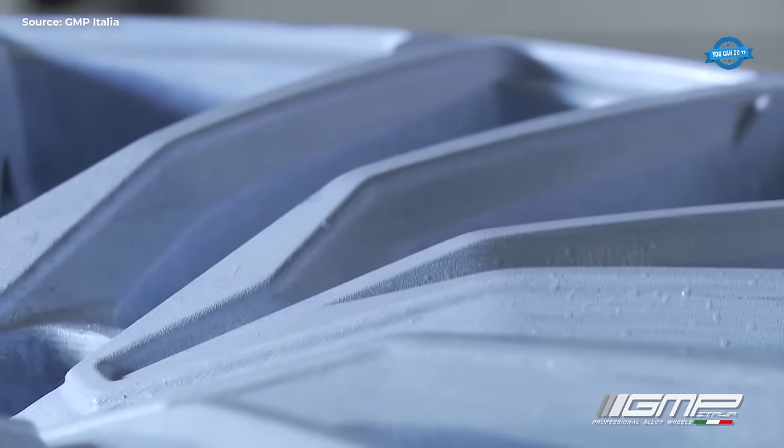The first crucial step is the preparation of the alloy bath, which involves purifying the bath to eliminate impurities. This meticulous process is fundamental to ensuring the final product's quality and integrity. Following the preparation of the alloy bath is the degasification operation, which involves removing trapped air from the molten aluminum using a sodium metal tablet. By eliminating air pockets, the risk of microporosity and irregularities in the cast pieces is significantly reduced. The pouring procedure is another essential aspect; timing and method are critical, as they directly impact the quality of the final product. Proper pouring ensures uniform filling of molds and precise casting.